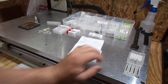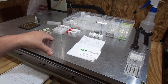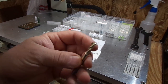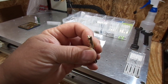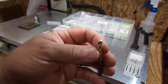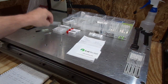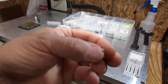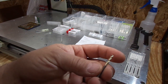I've retired all the uncoated stuff and just use it for wood and plastics. When it comes to metal cutting I've been using three-flute end mills. I have a quarter-inch from Online Carbide — ZRN coated, three-flute quarter-inch end mill. That coating works great; aluminum doesn't clog in there providing you're cutting smart with it. If you start rubbing it'll clog. The eighth-inch three-fluter — the only time I've ever clogged it is right on the very end when slotting. With adaptive I've never clogged these, and I run them dry.